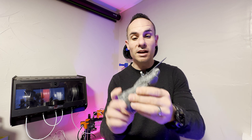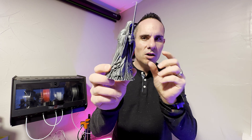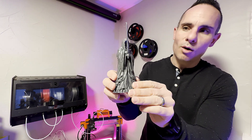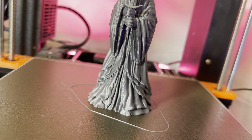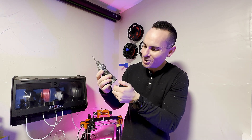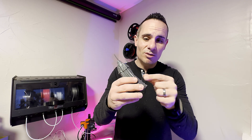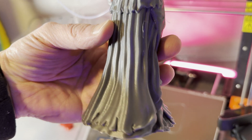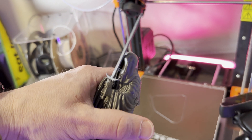That's so much easier. This model was printed at 0.1 millimeters, so this is a pretty small, highly detailed print and you can't see any layer lines really. For an FDM print, this is about as good as it gets. I'm really happy with that. These other supports just fly right off — that's so crazy. So far I've got to say I'm really impressed with this nozzle. It came through and did exactly what I'd hoped. I'm going to print some more abrasive materials with this — maybe some carbon, definitely some wood infill PLA — and we'll see how it stands up to the test of time. But so far, so good.